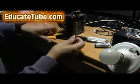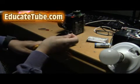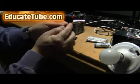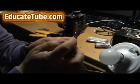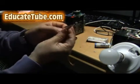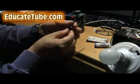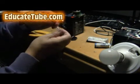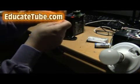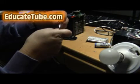Solder it to your wire. Then I would solder in here. I'm going to solder there and that should be okay. Then this plastic heat-shrink tube will just place here — in fact, you want to heat this plastic tube so it will shrink into place. And then the other end, using the positive clip terminal — it's red, that's why it's indicated as being positive. Move the plastic down. Same thing — I'm going to solder it later.